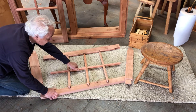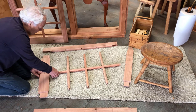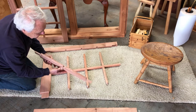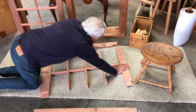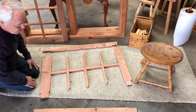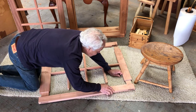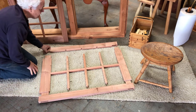The way this has to go together: the vertical stiles are last. The lower rail fits in there, and for the upper you can see there are little sockets in these V-cuts that the mullions go into. These are through-tenons, so they go all the way through — that's typical of strong, classic doors and sash like this. So that comes together.